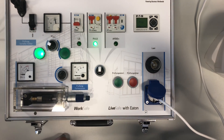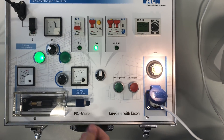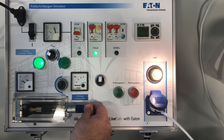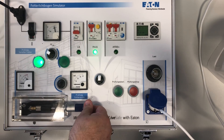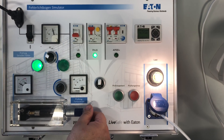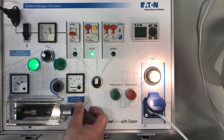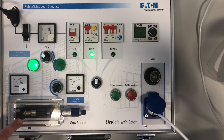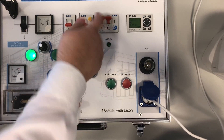Right, we go to RCD. Switch the RCD on — press start again. So we're now running on a full heater load and we're currently pulling about seven and a half amps. It's very, very delicate this. So we've got an RCD — you can see there's an arc. Eventually it cuts out from the arcing, but the RCD's still on. So we trip out the RCD.